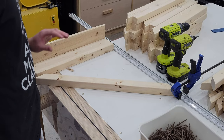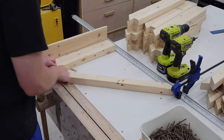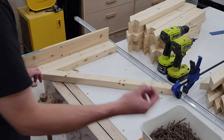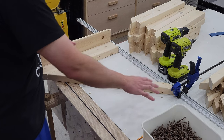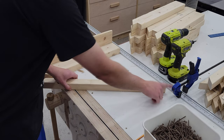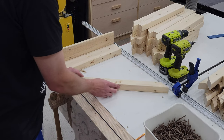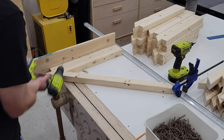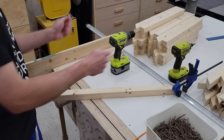Before attaching things to the back piece, I want to pre-make these little subsections — the 45-degree angle piece and the bottom piece. I want to attach them with a 3.5-inch construction screw going through for maximum bite. I have a jig set up with positive stops to keep everything simple so we can batch these out without thinking too hard. I just place the piece into the corner, drill the hole, add construction adhesive, drive in the screw, and move on to the next one.